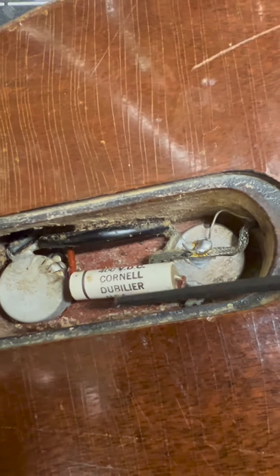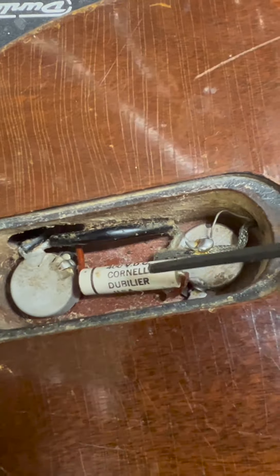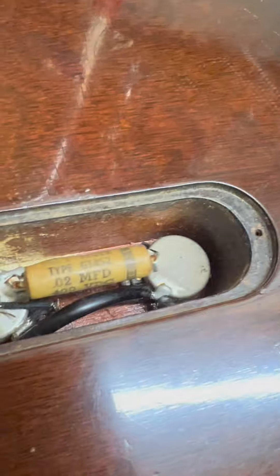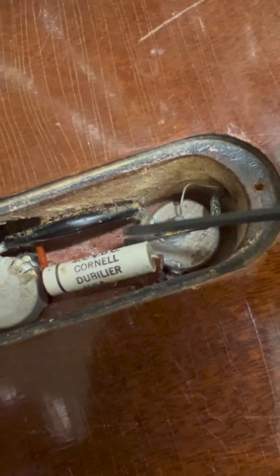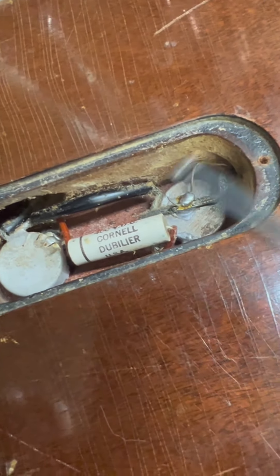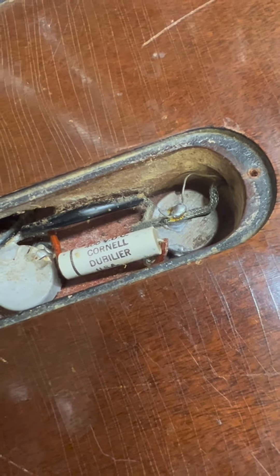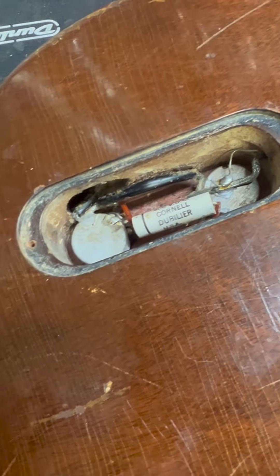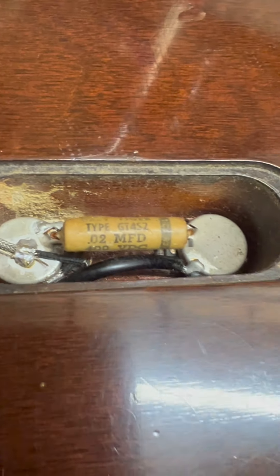Don't be fooled by something you've never seen before — take a minute and look it up. Those Cornell caps came quite a bit on 1956 guitars, you'll see them a little bit later too. They did make amplifiers. This is typically a capacitor you'd find on Gibson amplifiers, and they would walk down the hall and grab one in case they ran out of gray tiger caps. These Cornells are a legitimate Gibson part. There you go — just thought I'd share that with you. Geeky, isn't it?